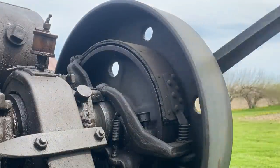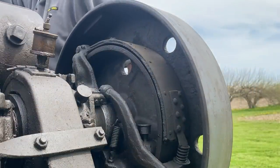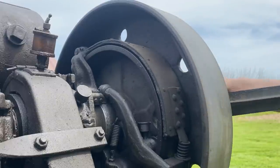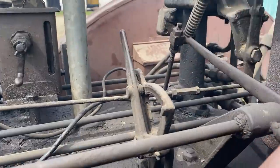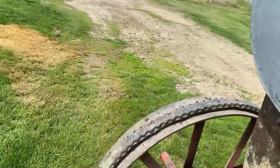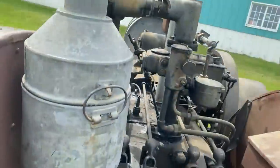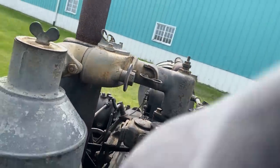I could hear the impulse clicking so I don't think it tripped. I'll try putting the choke back on to see if that'll help things. We're actually going to push the ignition timing just a little bit more forward. Get up here and push the choke off. That tractor likes it if you turn the needle valve in a little bit.